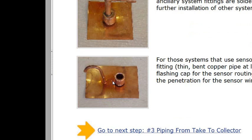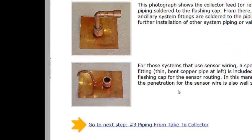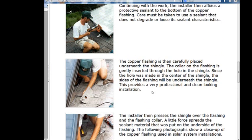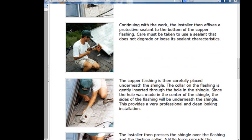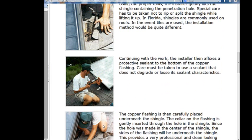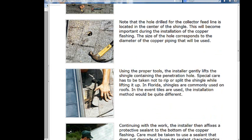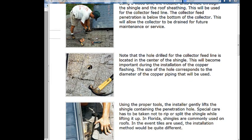Sometimes we may need to bring an electrical wire down — that's the sensing wire for temperature. Notice the U-shape right here that the wire goes into to keep water from entering. The biggest concern with PV and solar thermal roof installations is water getting into the house. Take extreme care at this point. It can be a rough operation — tugging and pulling — but we want to mitigate any tears, cracking, or destruction of the shingles during the install.